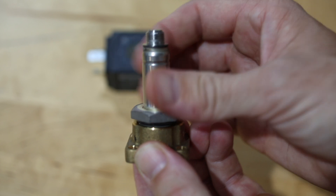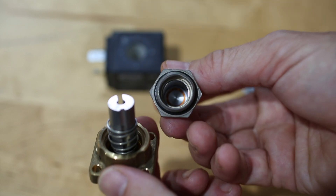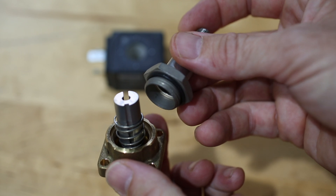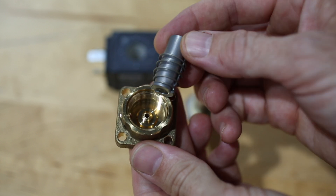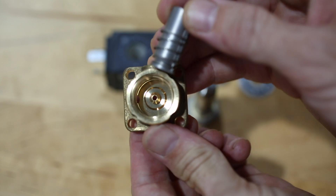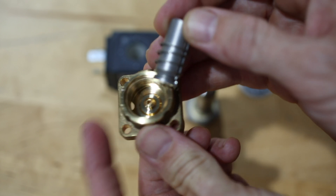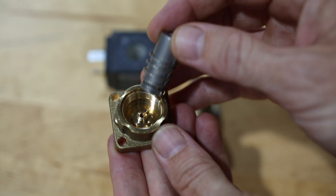The valve stem will come off with a shifter. Inside, there is a little plunger loaded on a spring, with a valve and a seat on the inside. This is what moves up and down and allows the water to pass in and out — similar to a little tap. The coil is controlling this electronically via a magnet: open, close, open, close.